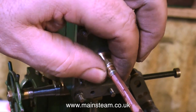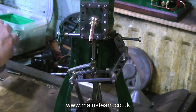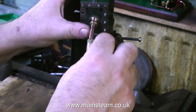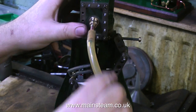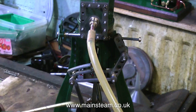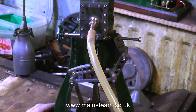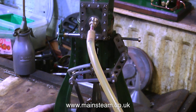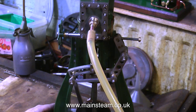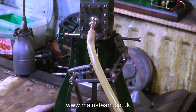I silver-soldered a union nipple to a piece of copper pipe, and here I'm fitting it to the engine. I haven't cleaned the pipe up because it's only a temporary thing. Normally at this point I'd be getting quite excited, but I'm really not excited with this engine in any shape, way, or form. The more I look at it, like a lot of these engines that you see me repair, the worse it gets. This has been made by a raw beginner — maybe a school, maybe some sort of apprentice piece. Parts of the engine are reasonably well made, and other parts are just an absolute disaster area. The timing is completely out; it's not going to run. With compressed air applied to the inlet, nothing happens — it's just blowing straight out of the exhaust port, which means the valve isn't in place properly and the piston is blowing. We shall see when I dismantle it further. But never mind, it keeps me off the streets.